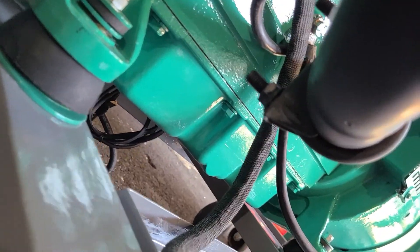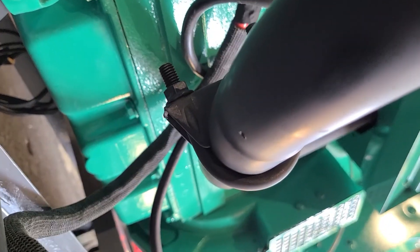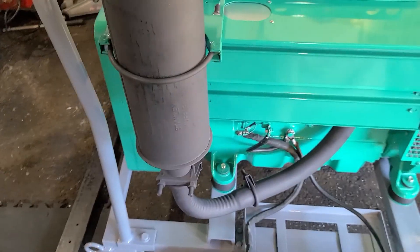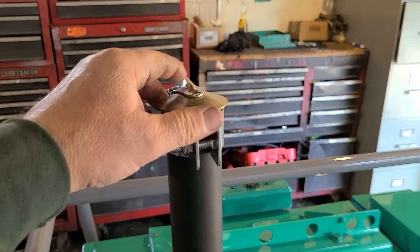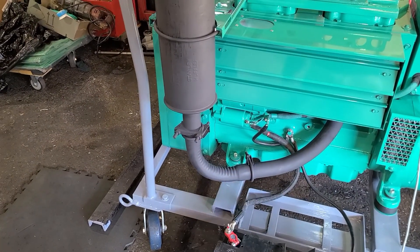It's basically going to end up down here and eventually blow out. It was suggested to put a little weep hole at the bottom — it's an eighth-inch hole. These generators are noisy as it is, so it won't add much noise, but any liquid will end up draining out of there. It's also a safeguard: if this flapper happened to hang open and rainwater got into the muffler, it'll end up in here and drain out the weep hole.